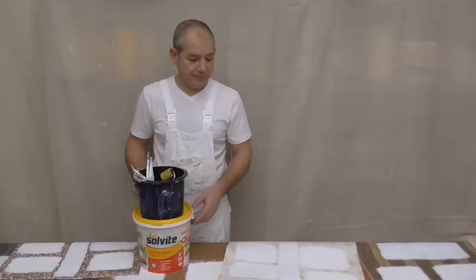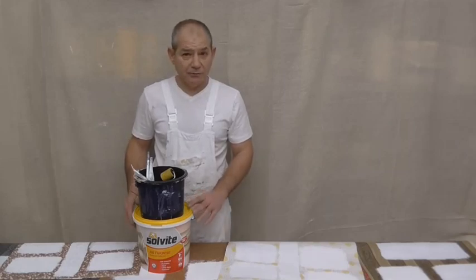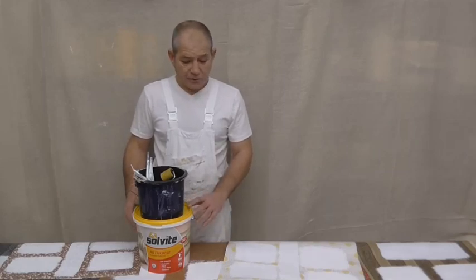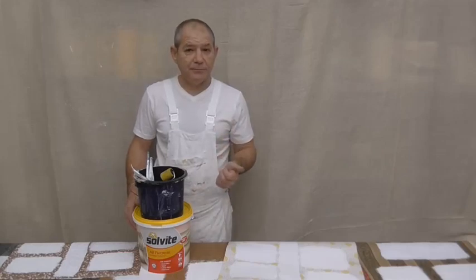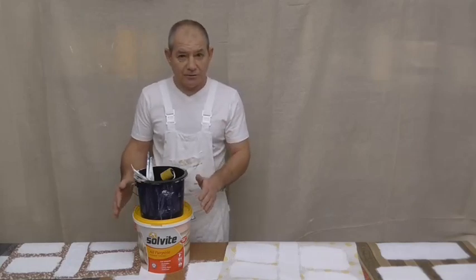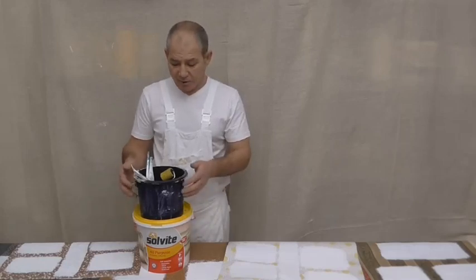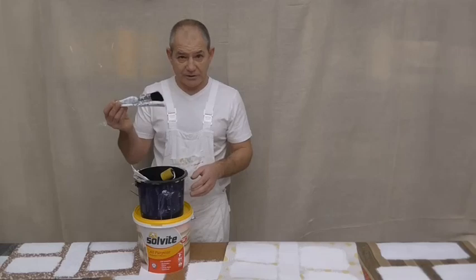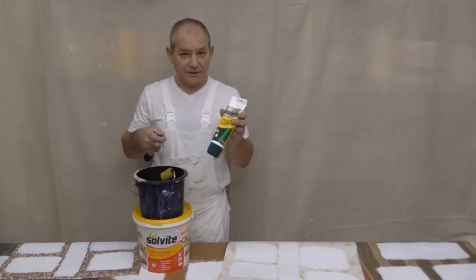Painting over wallpaper is easy, but there are a few things you need to look out for. So, first of all, how well is the paper on? How bad are the joints? Is there any edges lifting? You may need to go around and do some sticking back. So either ready mix paste, a pot and brushes, or if it's a small amount, overlap adhesive.